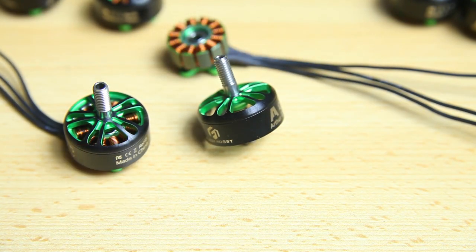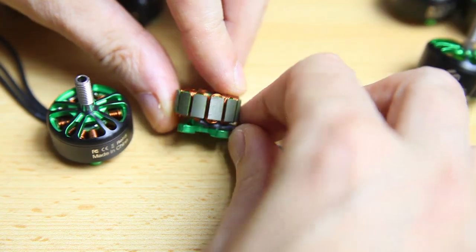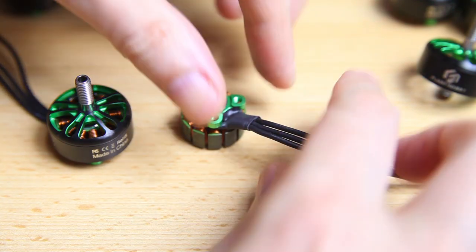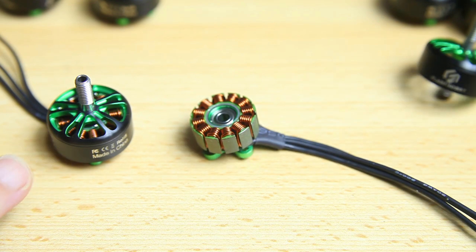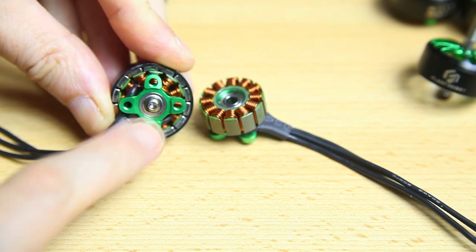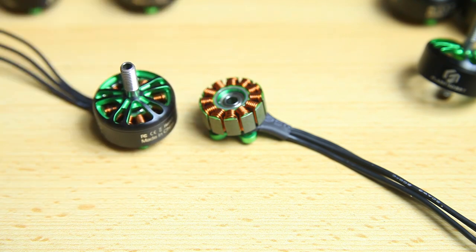The magnets aren't curved, and I don't see a lip underneath the bell to prevent magnet slipping. To be honest, I've never had magnets slip out of the bell — maybe if you run your motors too hot, but I've never had that happen. The bearings look very normal; the main bearing diameter is 8mm, which is standard. The wiring is nice supple silicone wire. It has a hollow shaft, no C-clip — a screw holds the motor together — and it's an open-bottom design.